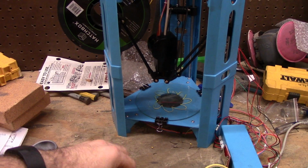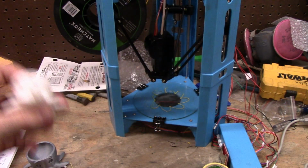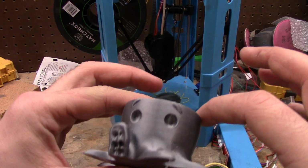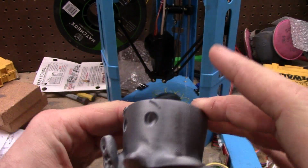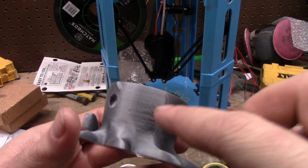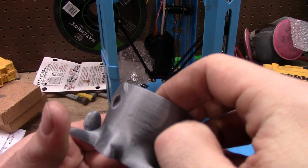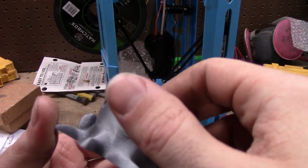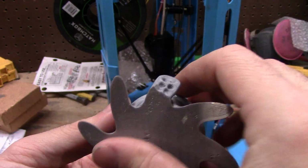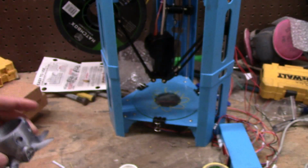But anyways, I've done several prints. I've been concentrating on this little guy, the cute Octobowl, and I'm going to go in order of print. So start off with this one I printed with my Wilson 3D. This is what I'm considering the control. It is fine enough that these defects are, I'm pretty sure, slicer rendering defects, not stepper defects, from, I believe, only 128 steps per rotation on my Wilson 3D printer. So I consider this good, crisp, no stragglies, no nothing.